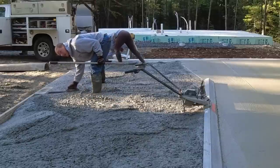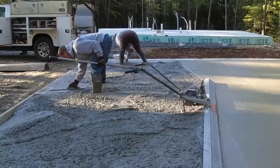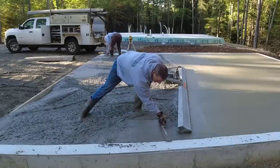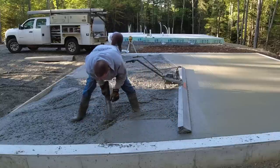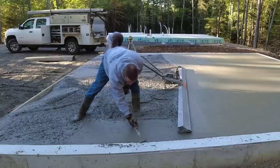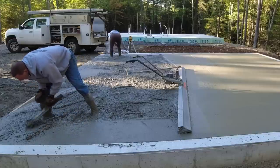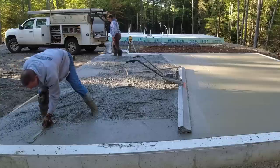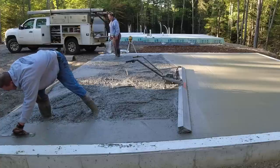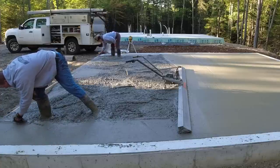Now Tia's over there magging that edge to top of wall, and I'm magging that middle piece right there to top of wall, and I'm going to use that as my wet pad. This is how we mag the edges — you could ride the screed on top of the hard concrete right there, but like I said, if you get any paste or a rock on top, the screed is going to want to ride up over those and you're not going to be as accurate. So it's best to mag float your edges like this, get them nice and smooth, and then use that as your pad to screed off from.